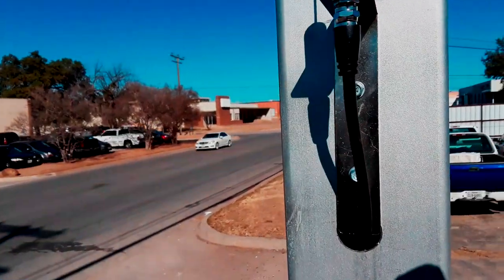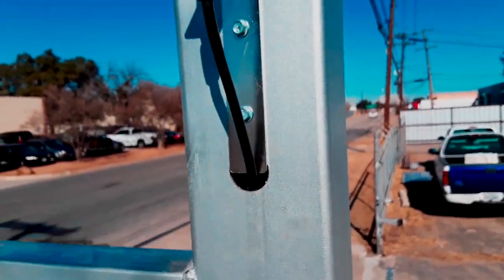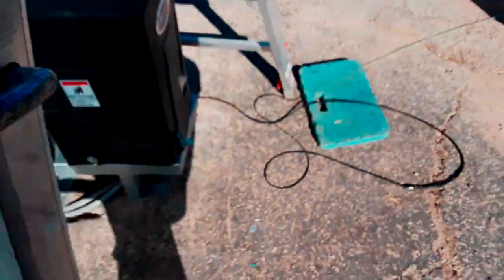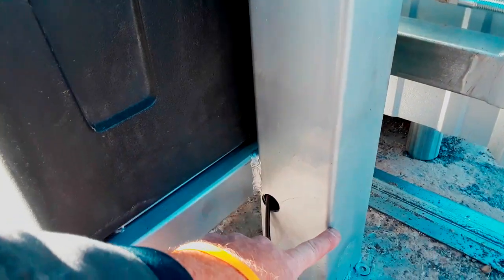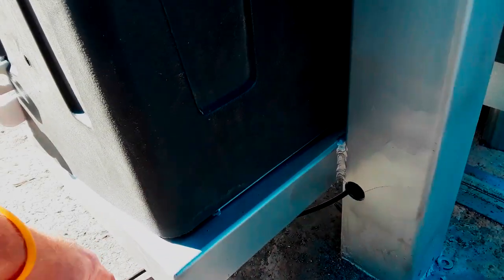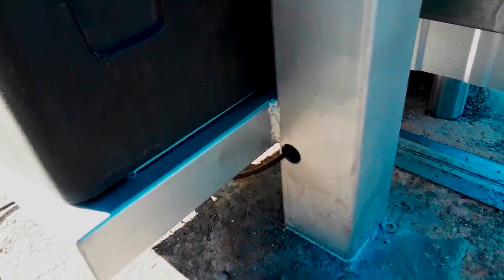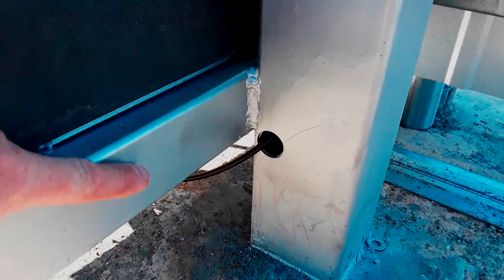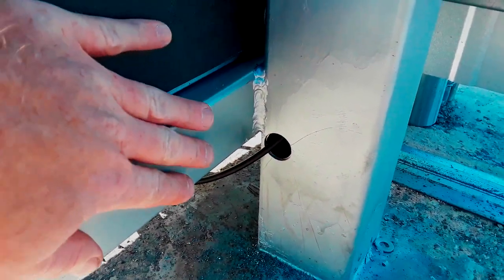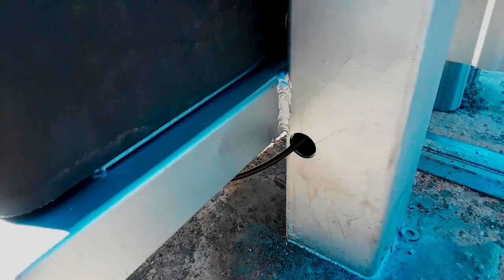This sleeve helps keep water out from between the antenna and the adhesive. That's the proper way to run the antenna. Cosmetically that's all your customer sees. Down at the bottom when I mount the photo eye I'll run conduit down to it and over to here - that'll cover up this hole. All you'll see is the conduit for the photo eye, not the antenna. That's the reason for the location - just below where the gate frame mounts to the guide post - because the conduit is going right over it so you really won't even see that hole.